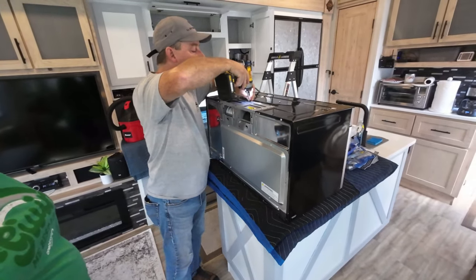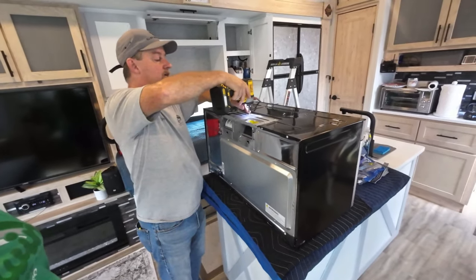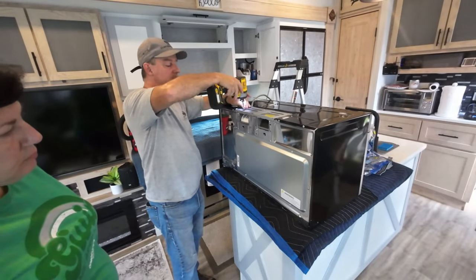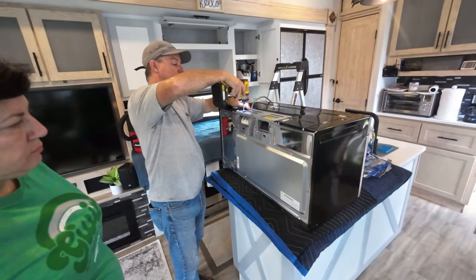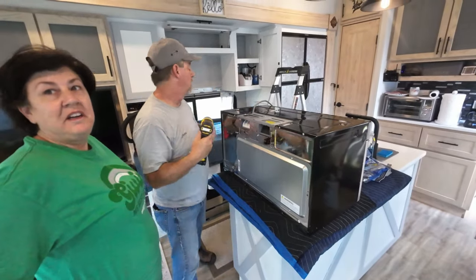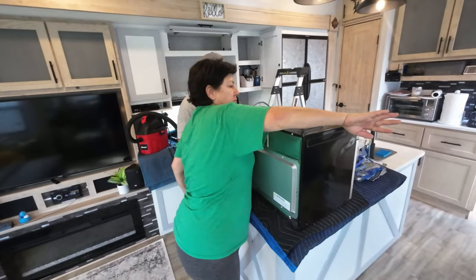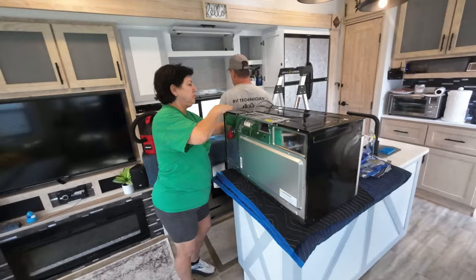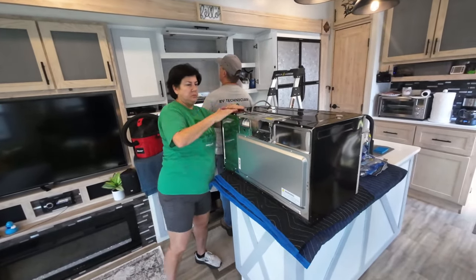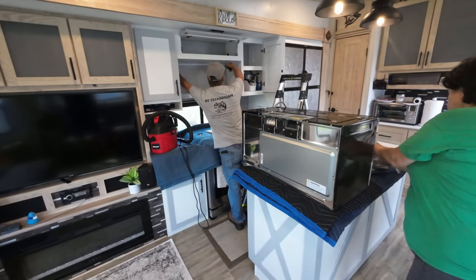Also, notice I am using a drill driver, very lightly, not using impact. That's key to all of this work. Never use the impact. I wish the manufacturers would teach their employees to do the same. On the production line, I'm sure it just quit. And it's not that hard to learn. You can pump screws in one after the other, torque them down without breaking or stripping.